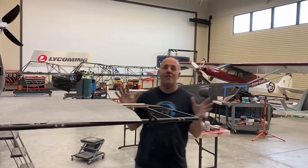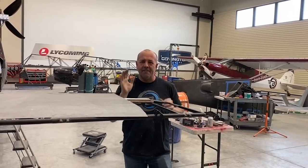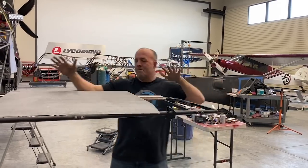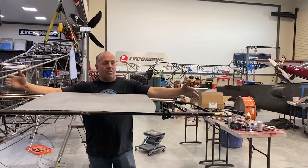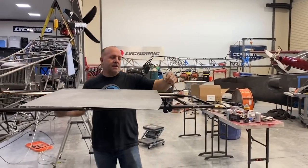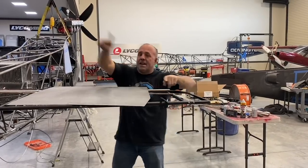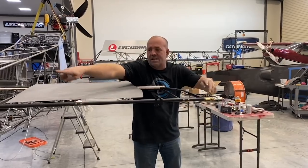We know I'm adding carbon all over this aircraft. My vertical is now carbon. My elevator and my rudder are going to be fabric, but I do want my horizontal to be carbon fiber. I've enlarged it now 10 inches a side. I've made reinforced brackets, moved them further out. I've added three hinge points instead of two.